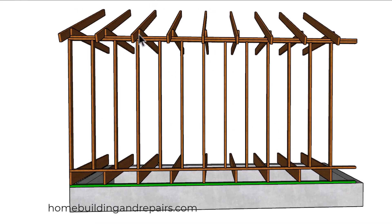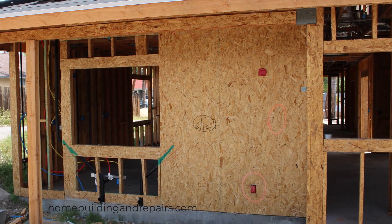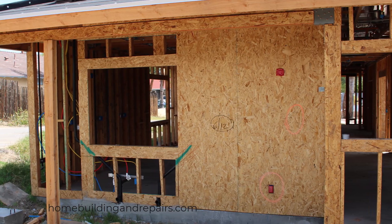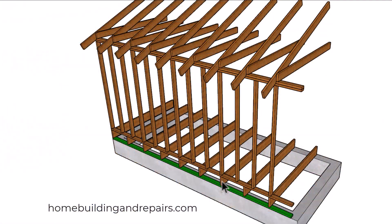However, if I switch the rafters and the floor joist to two foot on center, then the only joists, studs, and rafters that are going to line up will be every four foot. This might not be that big of a deal depending upon the type of construction and materials. If you're still going to be using four-foot or eight-foot wide materials for your sheathing and drywall, the only problem is that the load won't be transferring from one component above directly to the other component below in every situation.